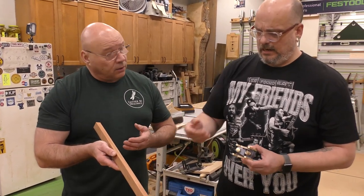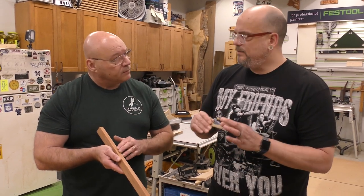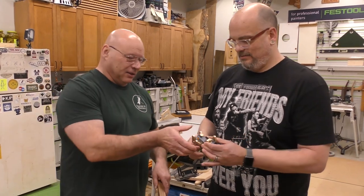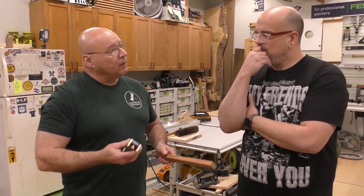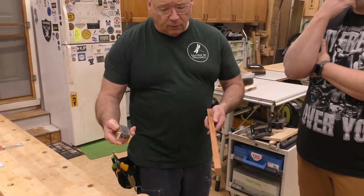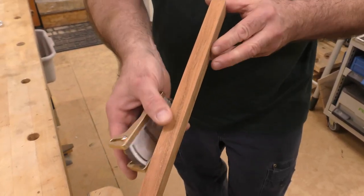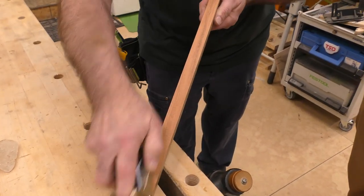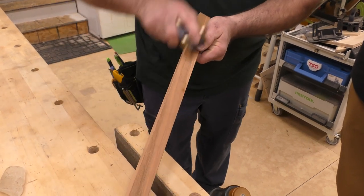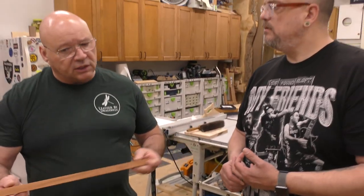The majority of the time I'm using a block plane, it's right here in my pouch. I take it out and I'm knocking over edges — say you just hit this with a bench plane. Feel that sharp edge? You're knocking off edges like this and you're going to see these little curls come off. What we call breaking an edge. It's just knocking it down — a very minute chamfer. It's called breaking an edge, so that way it's a little softer when it goes into assembly. You're not ruining any of your accuracy of your joinery.